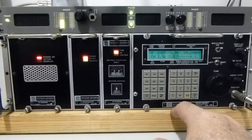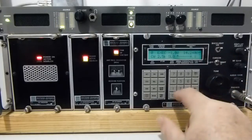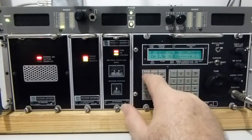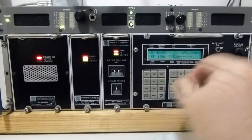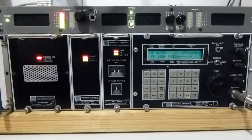I'll just now go through to the VUHF side of things. We'll scoot up to the FM broadcast band and see what the quality sounds like up there. 105.3 is a local radio station. You'll need to change it to FM of course, and take the bandwidth out to something reasonable. I don't know what the speaker's like on the camera, but it is coming through — very beautiful, very nice fidelity.